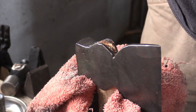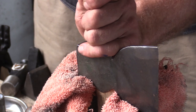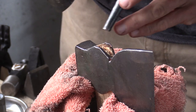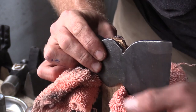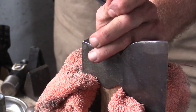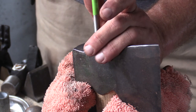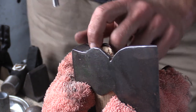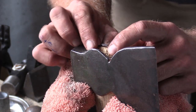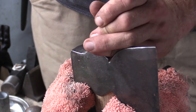I'm going to take a punch — just a punch I bought at a hardware store — and get a heavier hammer this time. The punch basically drove in and the wood didn't go anywhere. So what we're going to do is reevaluate, make sure nothing's binding up, and open this up just a little bit more. My guess is that whoever did this epoxied this handle in, because I'm chiseling away at these sides and the sides are not even moving, even where it's broke away from the axe.